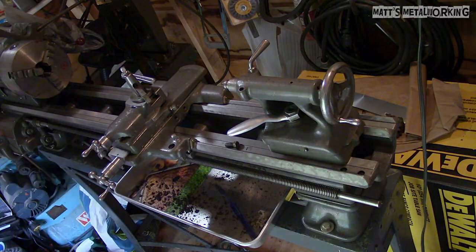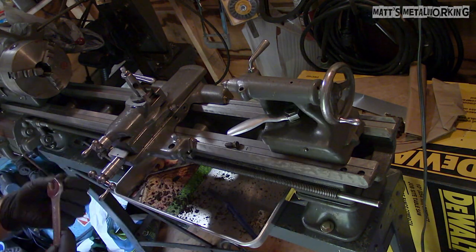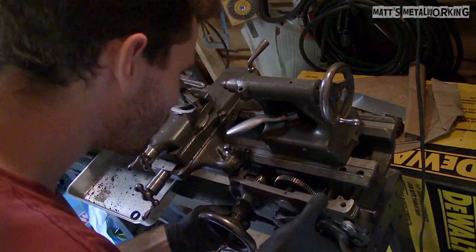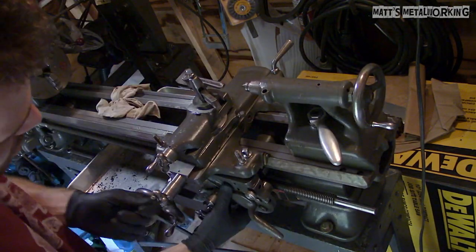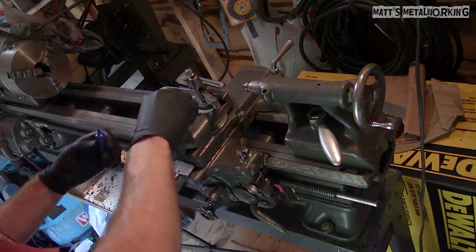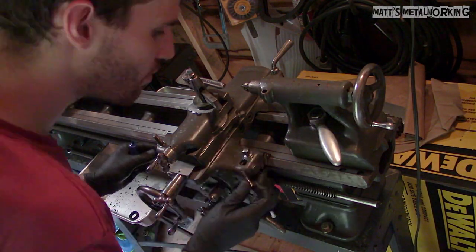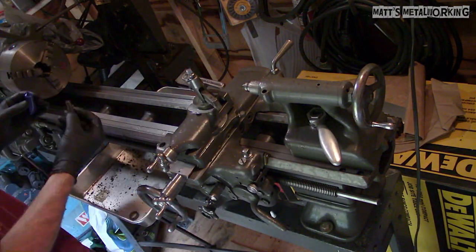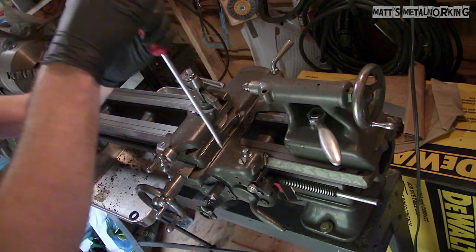Once I was done with the cleanup I applied new lubricant. Instead of the traditional oil required for the lathe, after doing a little research I switched over to what I personally think is a more modern replacement — something that reduces friction, withstands heat better, and has better surface retention. I'll save that for another video if there's interest, so leave a comment below. I also used medium grade thread locker on the carriage bolts to prevent seizing and stop them coming loose from vibrations. Once everything was back together I adjusted the gibs on the cross slide to remove any play, so it maintains accuracy and nothing moves around when cutting.